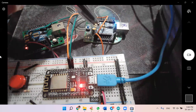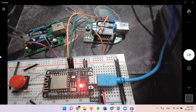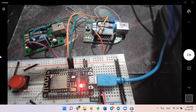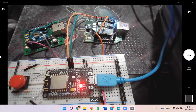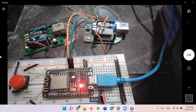And this is the receiver — I have made this Zigbee as the receiver, with 'R' written on it. So the Zigbee with 'C' will become the sender and the one with 'R' will become the receiver. This coordinator is serially connected to our ESP, and the ESP will be sending data to this coordinator serially.